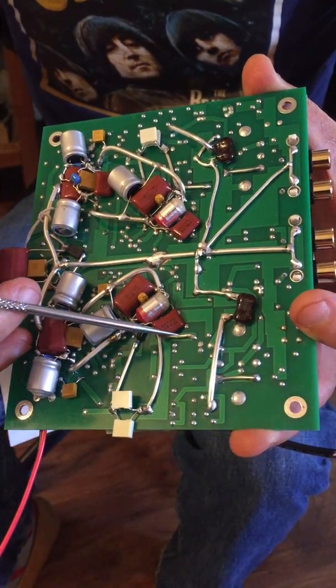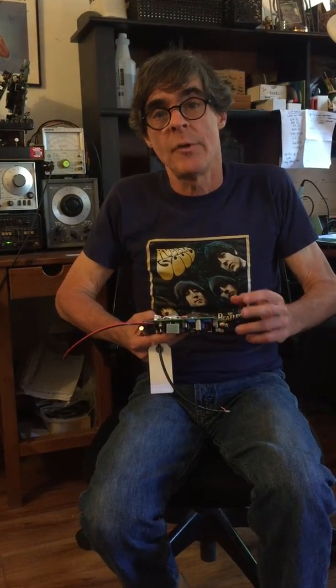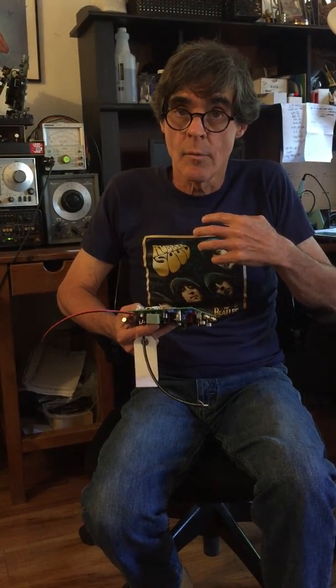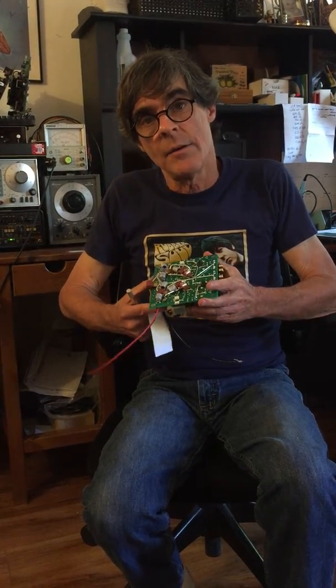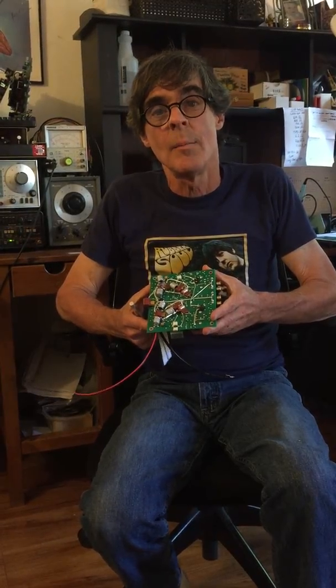For the audio section, I have a rule: when you're doing audio with silver wire, you don't put silver wire where there's audio voltage — you put it where there's what's called virtual ground. In any operational amplifier, whether it's transistors, tubes, or integrated circuits, there are always parts called virtual ground where the audio current is running in current mode, not voltage mode. That's where I use silver wire. I don't use silver wire on, say, the output of an amplifier where audio is running in voltage mode. All these things together make what is the LCR Silver. For sonic descriptions, you can go to our other video about the sonic differences between LCR Silver and LCR Mark III.